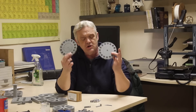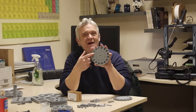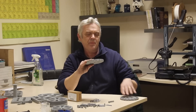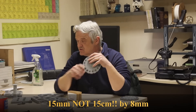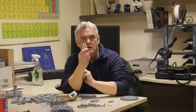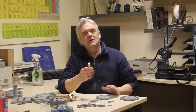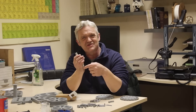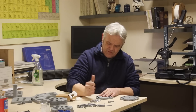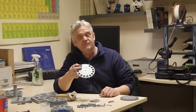The rotor comes in two sections, plus a whole load of these mysterious clips — that's clearly where the magnets go. There are 16 of these on each rotor, so I'm figuring we need 32 slots. What I was able to buy were 15mm by 8mm neodymium magnets, but I could also get 15mm by 4mm ones. Since each slot takes two of the thinner magnets, I need 64 magnets to fill the rotor. You alternate north-south, north-south — if you jam them in and swap them around as you go, you'll get that alternating pattern.